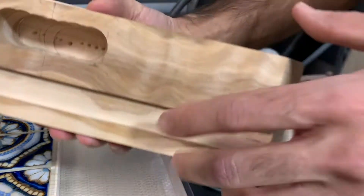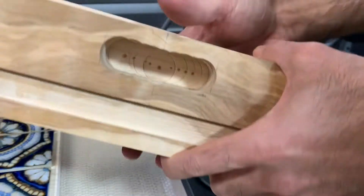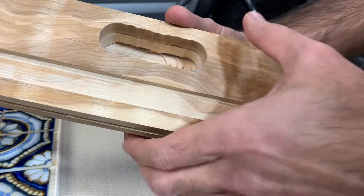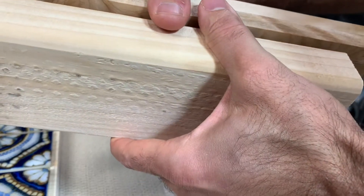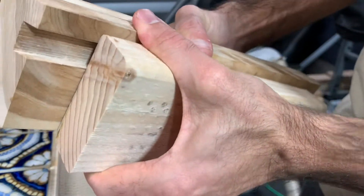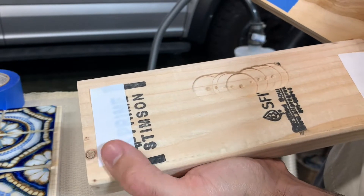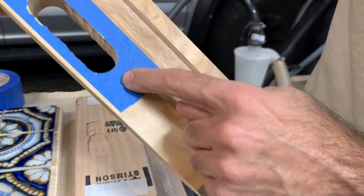To get the handle holes on these tray ends, I attached a 2-by-4 on the bottom side — that'll prevent some tear-out when the bit goes through. I moved the bit back and forth slowly; that's to prevent the bit from overheating, so you spend about the same amount of time drilling as cooling. I attached the pieces with double-sided tape — really good bond. I'll put a link to the double-sided tape in the description. You can see I didn't get any tearing when I took it apart.